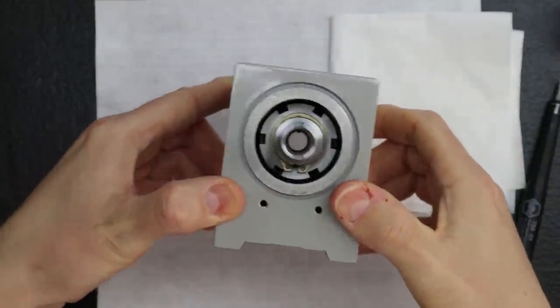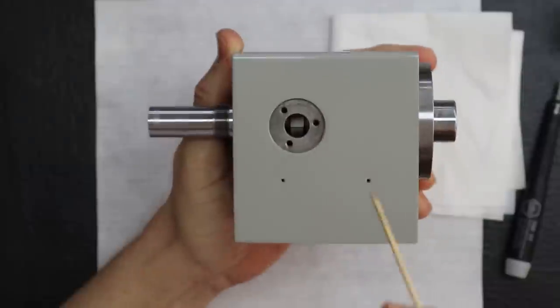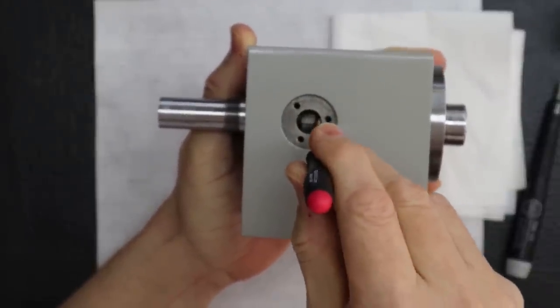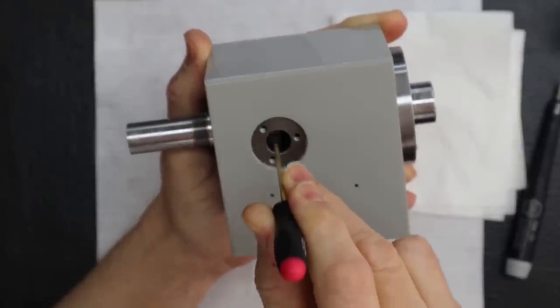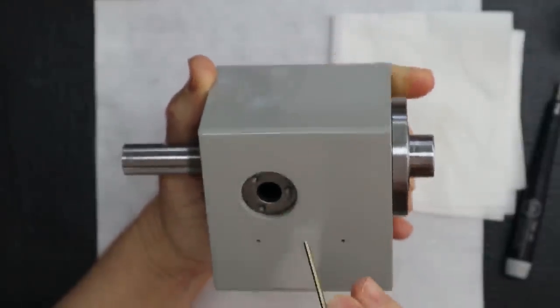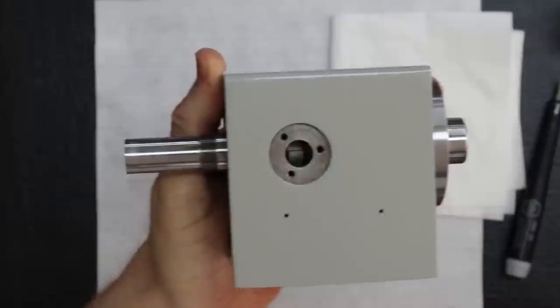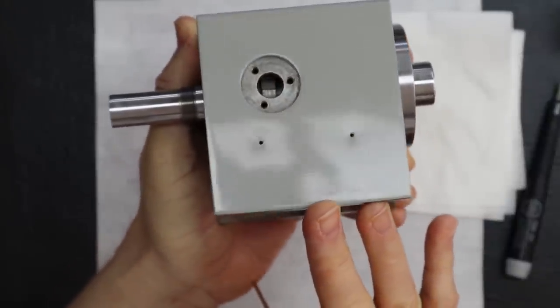Let's look through that side hole and see how we're lining up. Real nice for the locking pin. That's what you want to do. You can see the locking collar right through here, because the locking plunger is going to get installed. So that hole needs to see one of those six slots, because if it doesn't, we put that deep groove bearing on and there's nothing we can do about it. So it has to be verified right now. See it right there?